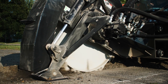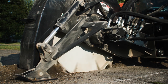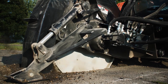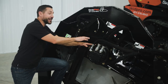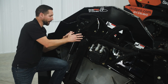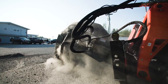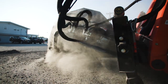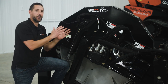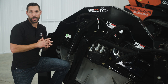There are three important factors with that. First, a big jump in torque for maximum cutting performance. Second, the planetary drive is very heavy, so it puts weight — nearly 100 pounds — right over the cut, giving you added performance. Lastly, that planetary is more robust than a motor and it isolates the motor, protecting it from shock and vibration, which adds to that longer life.